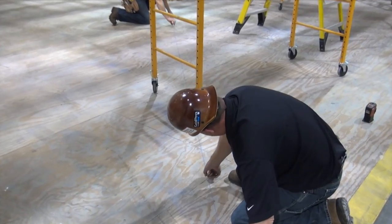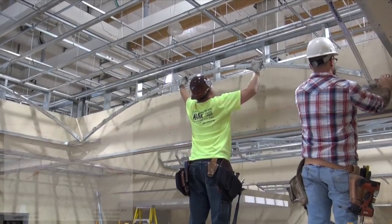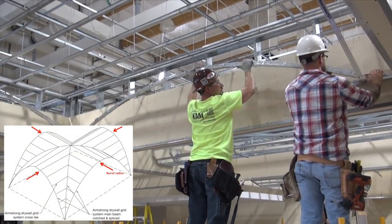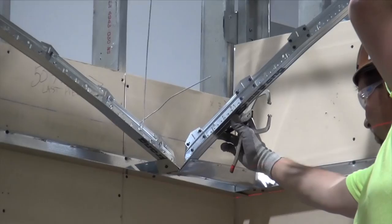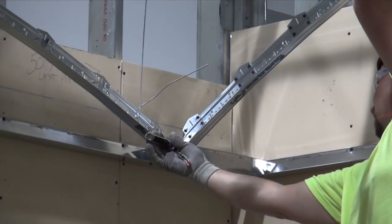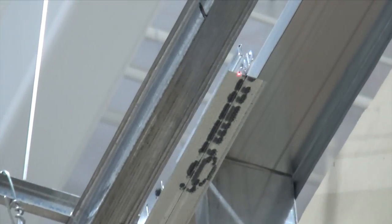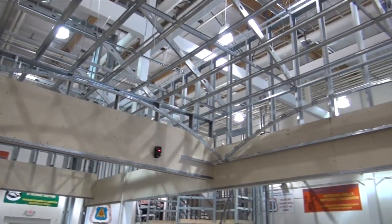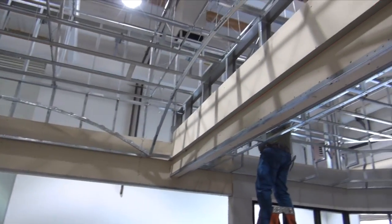Before installing, it is crucial to lay out your whole installation on the floor. First, we need to install your perimeter barrel vault shaped mains that you just made. These will outline the four sides at the perimeter of your groin vault. As you install these mains, constantly verify with a plumb laser that they are plumb with your outline on the floor. We are holding this installation off these walls to represent a stand-alone vault, as is commonly found on most commercial job sites.